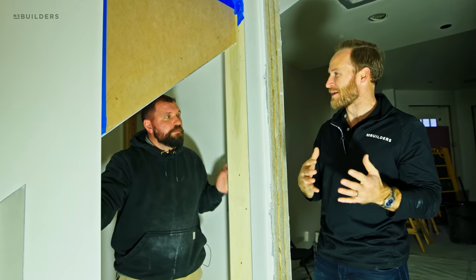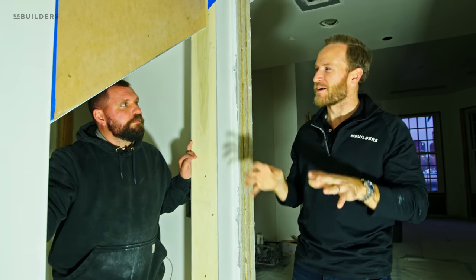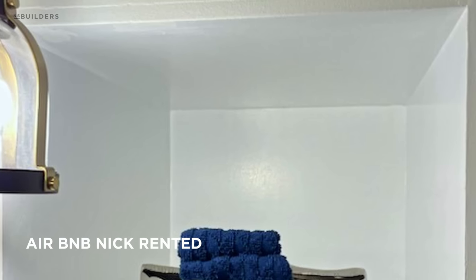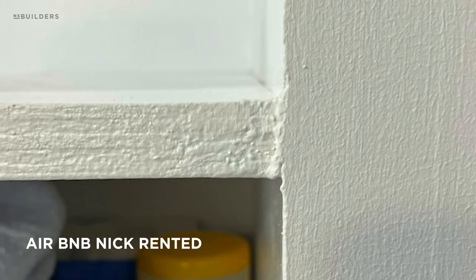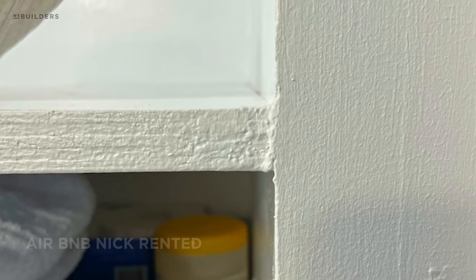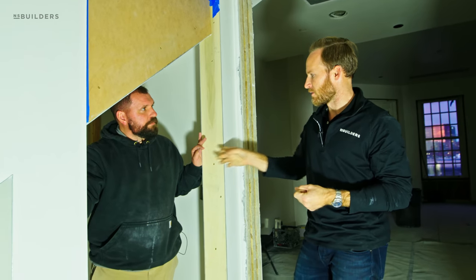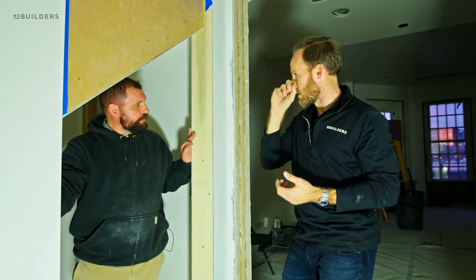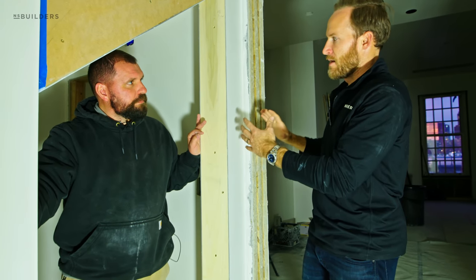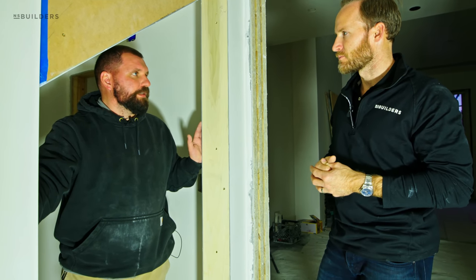I rented an Airbnb a couple of weeks ago and they had a plastered-in box for towels in the bathroom. I'm fairly positive they just stuck the MDF out and joint compounded it, because there was a crack about three-quarters of an inch all the way around. That's why we think intentionally about how to do this in a way that's long lasting — different materials can expand and contract differently. Colby has been really critical about making sure that transition is mesh taped in a way that creates strength and allows everything to become one. It looks like a regular bead, but we don't treat it that way.